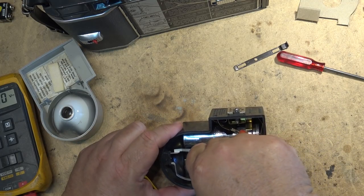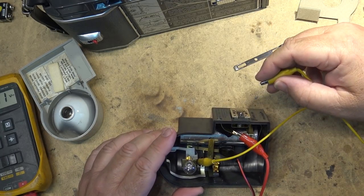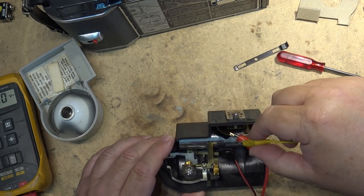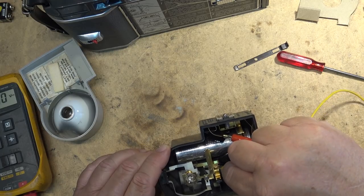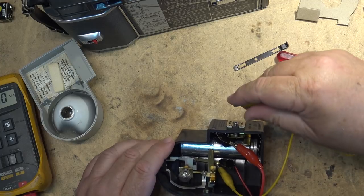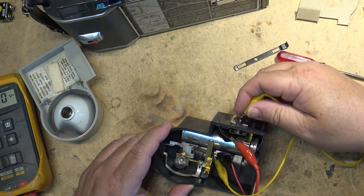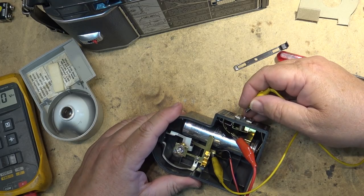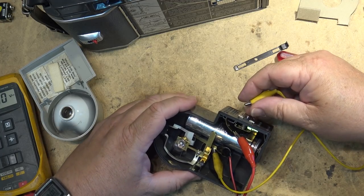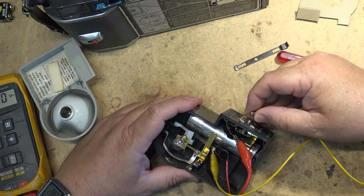So let's simulate the camera taking a picture. So I'll connect my negative terminal. I guess my negative terminal, or is it? Wait a second. This is my negative terminal here. And when I touch here, and that's what happens. It will just discharge that capacitor. It'll take it some time to charge up again. Now remember, I'm only charging it to 32 volts.